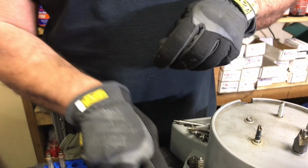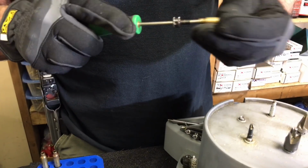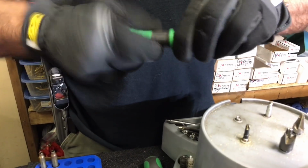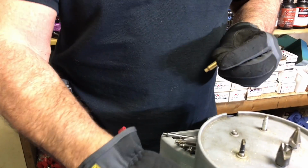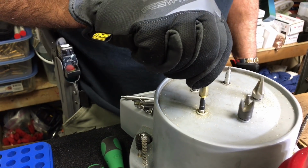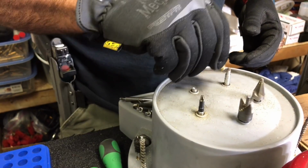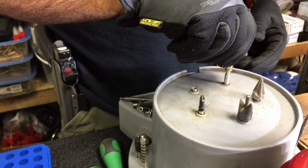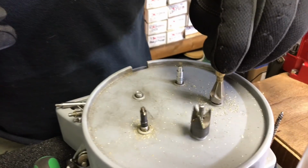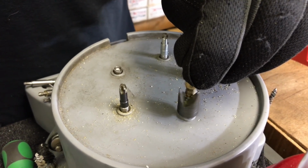I'm going to, really doesn't matter, uniform the flash holes. Cut the depth, make sure it's right. Get rid of that military crimp. Now there's a lot of swaging tools out there. I kind of like this one the best. Clean my primer pocket. Chamfer the inside of my neck. And deburr the outside and the inside real good.